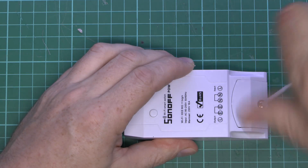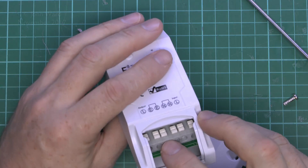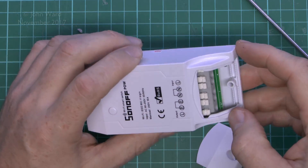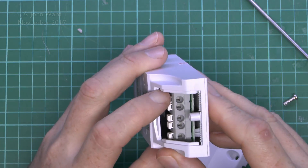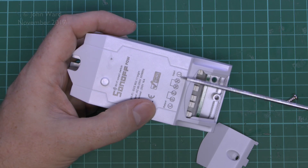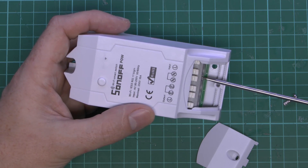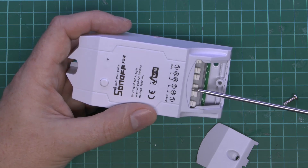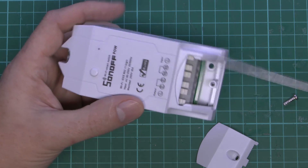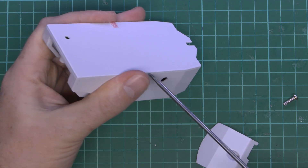So let's open this up. First of all, take this screw out of here and just see what's inside the terminal covers. In this case, we've actually got these sort of press-type connectors, as in you push down the thing and then just insert the wire into the appropriate slot. That's somewhat different to the screw terminals you saw on the previous device. The connections here are fairly straightforward, so we've basically got line and neutral coming in. Neutrals are common, so it's only switching the line. It's got a connection for earth on this one, which the other model did not have. And then our switched line output. There's a little tamper label if removed.